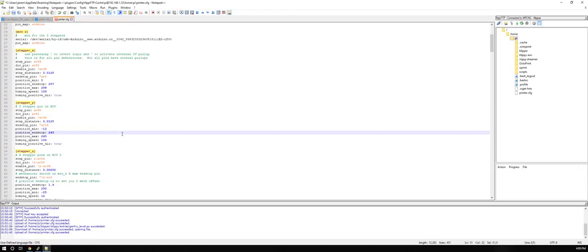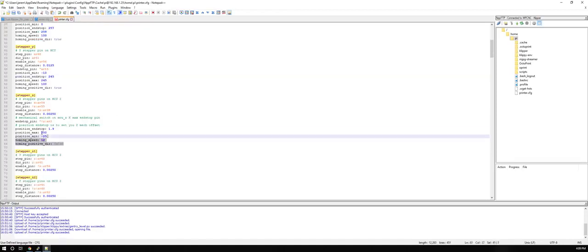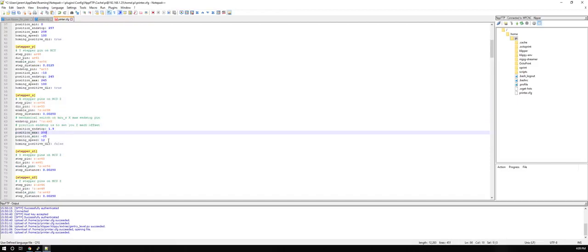Your end stops and your steppers for those end stops for that axis must be on the same Arduino, the MCU. So all the Z steppers are on their own. Your first one sets up the majority of the parameters. Step distance, you actually can change per each one. I actually dialed mine in to be exact. And what you end up with when you do that is layer inconsistencies because we're doing everything in 0.2, 0.15, whatnot.